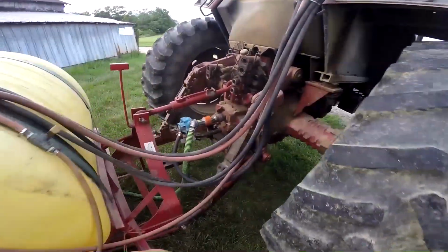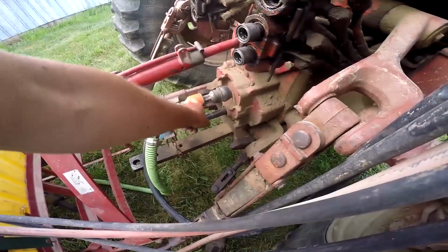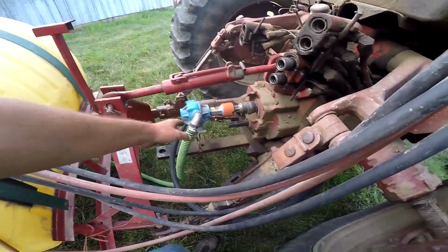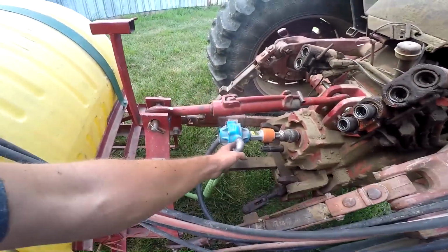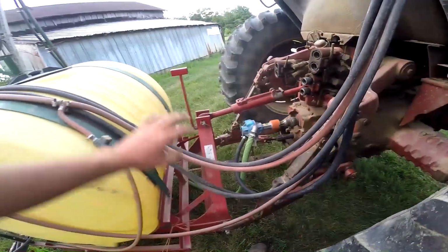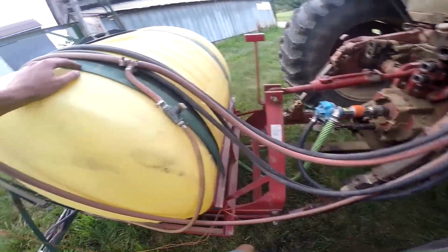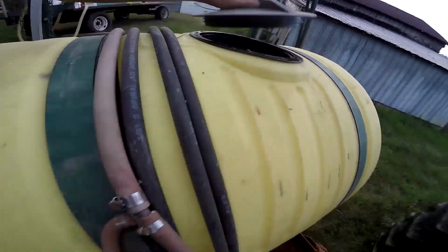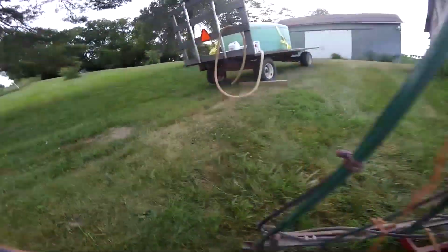Yes, sprayer. It's on the 1,000 RPM with an adapter. We're running low speed, about 1,500. Pump's max is 750, so as long as we don't run full RPM on the engine, we'll kind of stay at the upper limits. 200 gallon tank gets us about 10 acres.